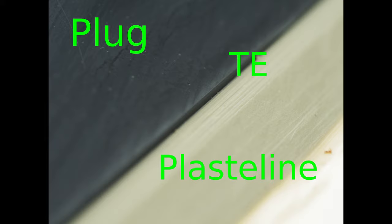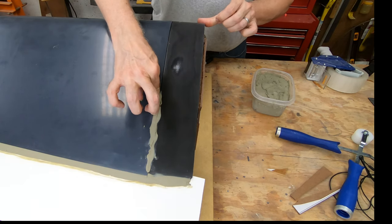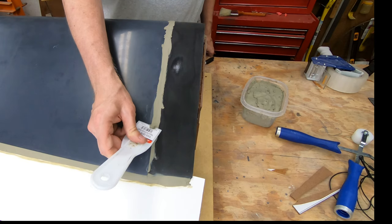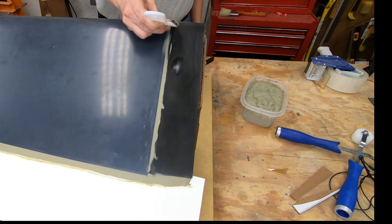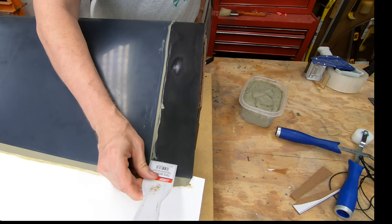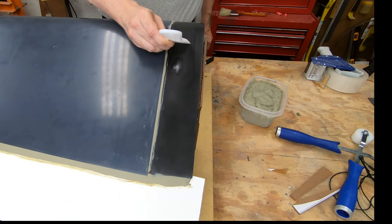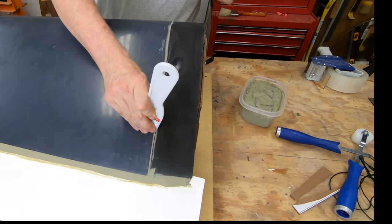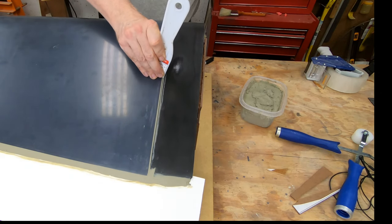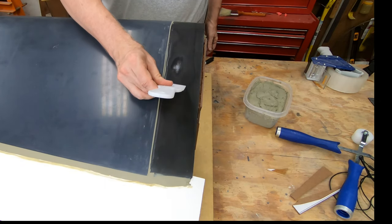The question would be: would I be able to get my plug out of the mold after doing that? Also, neither my plug nor the plug extension were perfectly flat on their mating ends, so I needed to put a little bit of plasticine down in that crack — I didn't want epoxy to run in there and glue my plug extension to my plug. But I also wanted just a little bit of an edge there that would show up in my mold, so when I made my part that edge would tell me exactly where to trim it.